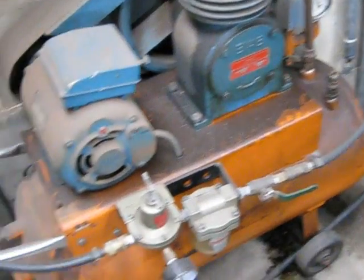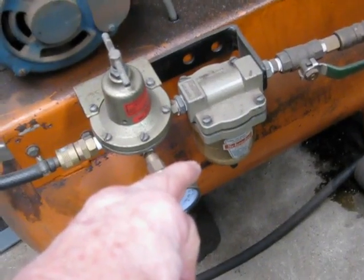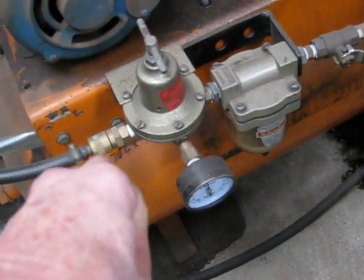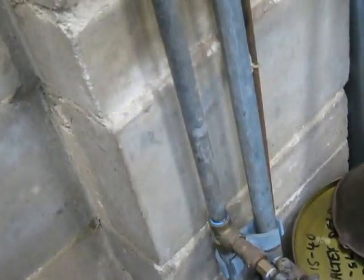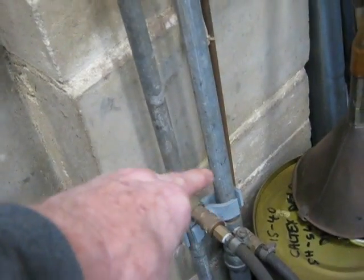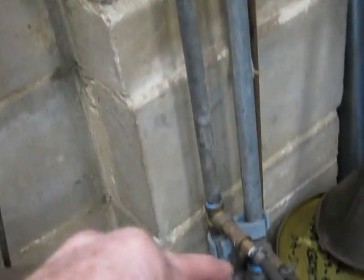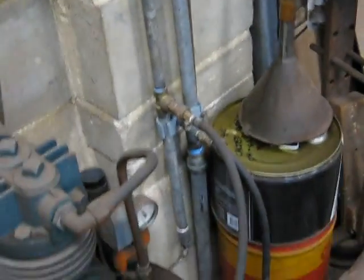By the time the air gets to the actual proper filter, it's cold enough that it will work properly — it's very cold. Also in the main pipe where the air goes in, you can put a big flat piece of steel, twist it into a spiral, and that will give it more surface area to actually condense out the moisture. You can do that in both pipes if you want.